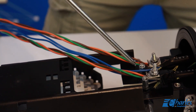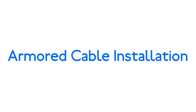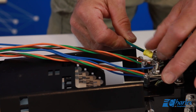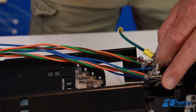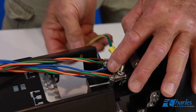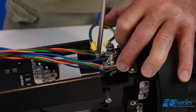Replace the attachment plate, securing it with the screws previously removed. Insert feed cable as described in the previous scenes. Install a bond clamp, usually customer supplied — for example, a 3M Scotchlok shield bond connector. Attach one end of the ground wire to one of the metal strength member posts and tighten the screw.